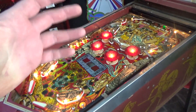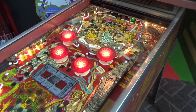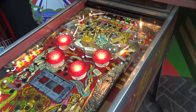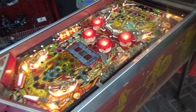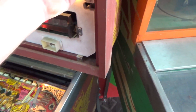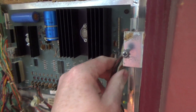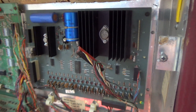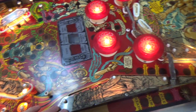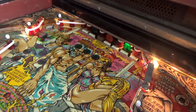The first thing you usually do whenever you're doing electronics on a Bally of this era — this is a Bally-35 MPU, which they used up to about 1983 — is work on the power supply. We did that in our first video, so go back and watch those if you haven't. The next thing the power does is come up here to this solenoid driver board. We've removed the top connector because that's where the power runs in, basically disabling all the boards. We wanted to get the light bulbs working on the playfield so as we shopped it, we could tell if the bulbs were burnt out.